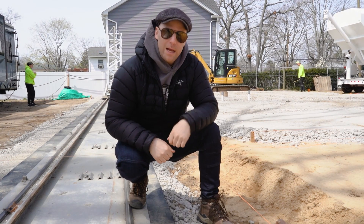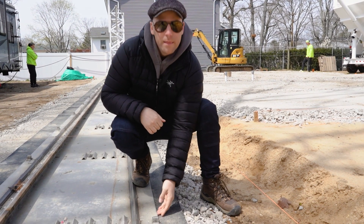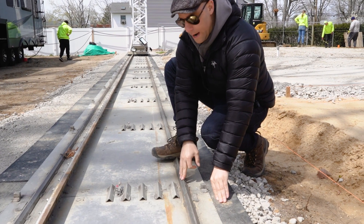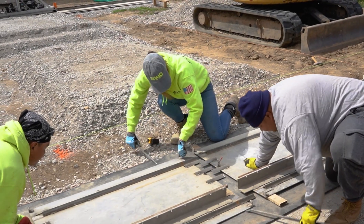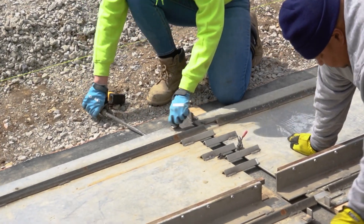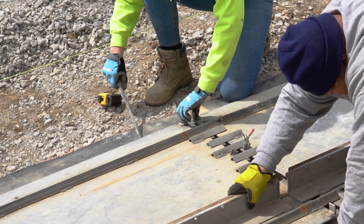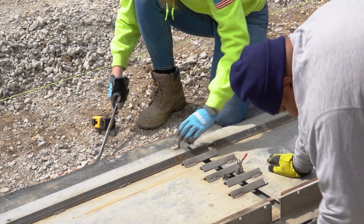It's going to be level and rock solid. After we tamp the RCA down, we put this foam pad down, then we install the tracks. You can see the tracks come together in three-foot sections — they're stainless steel, teeth on one side, track on the other, and they fit together with a simple clip. It's not extremely complicated; the technology is revolutionary. But when you look at each individual component and how they were built and put together, it's extremely simple. That's the beauty of SQ4D's design versus anybody else in the market.